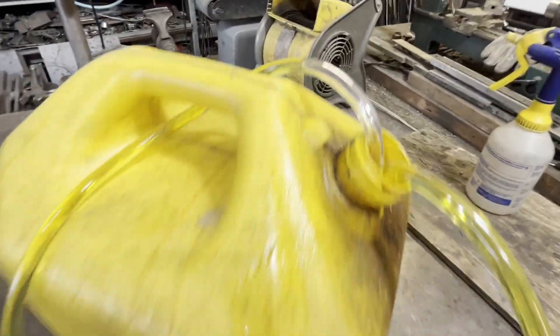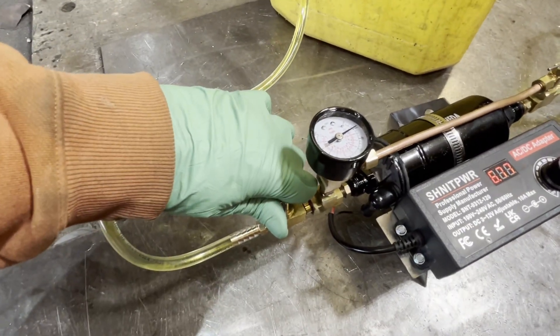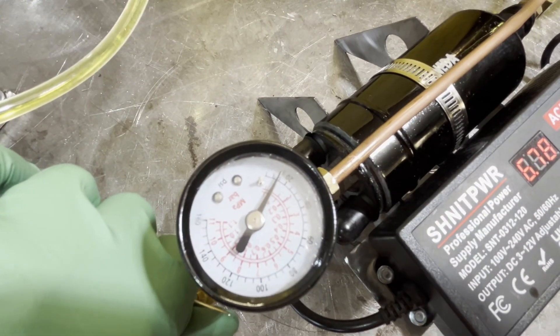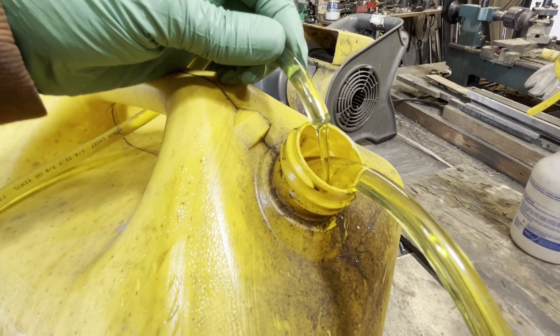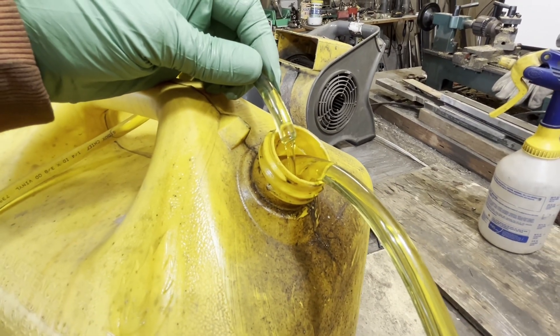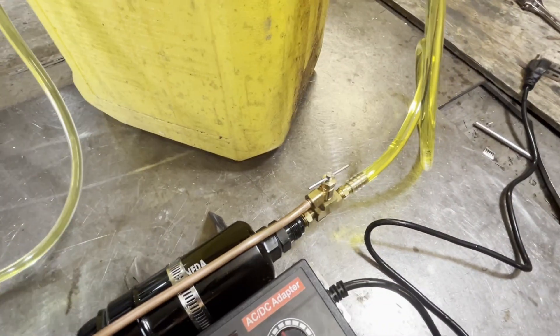So now we have no fuel flowing. Now that we know we've got some back pressure, we're going to open this valve a little bit until it goes down to about 10 PSI. And we now have produced a very specific metered flow of fuel or waste oil. That's what we look like with 10 PSI of pressure relief from the bypass system.